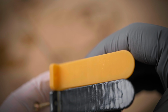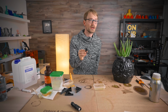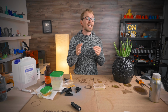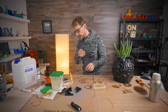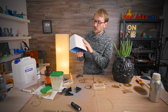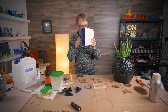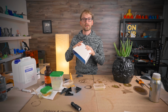I definitely like this resin coating approach a lot, and I think this is finally a good and quick and cheap way to get rid of print layers. I've experimented before with nitro filler, spray filler, 2-component bog. In fact, I've got some parts that I did with that here. And these parts do look smooth and nice and soft and all that, but they just took forever to finish. This took like 5 coats to get it this far.